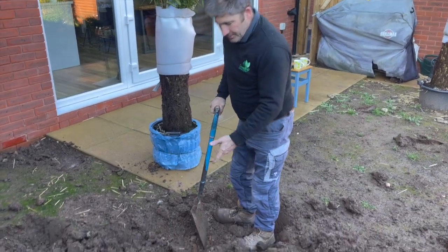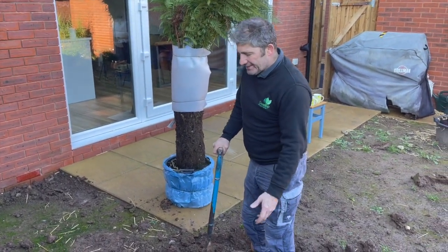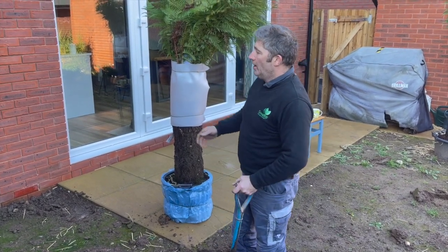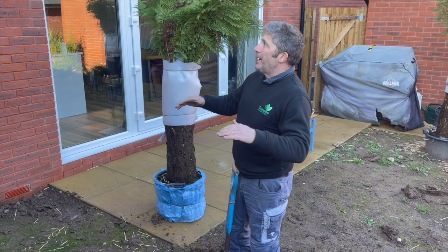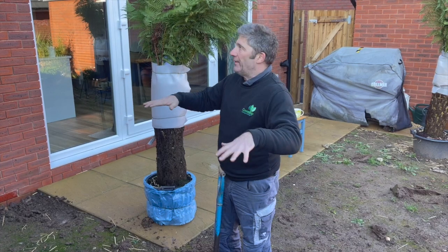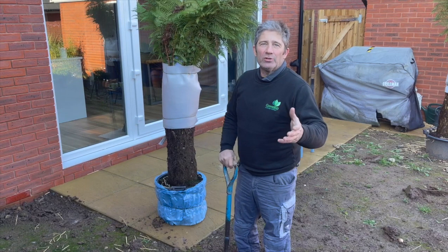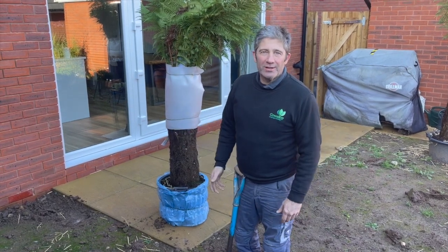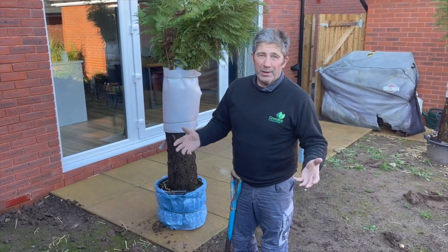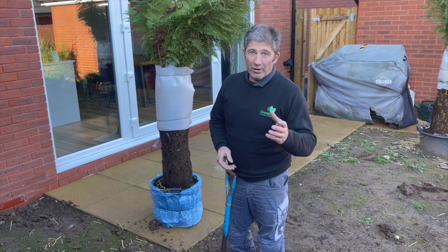So if you look here now, it's soft. Massively soft. It's an easy dig, but you can't leave it. If you were digging a foundation for a house, generally all the houses you see now are built on rafts, which are basically afloat, with steel in, so if it moves, it all moves. It's got to be consolidated. With a traditional conventional footing foundation, you can go really deep. Years ago it was 1.5 meters in places, and in Colchester many years ago we were doing a dig nearly 4 meters.